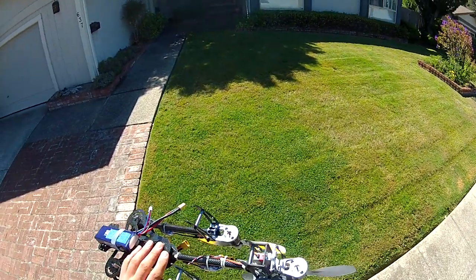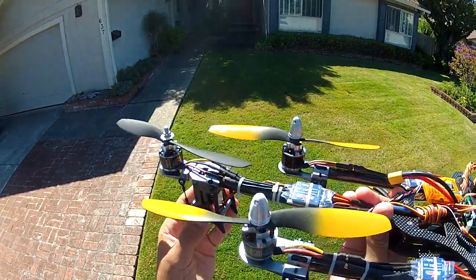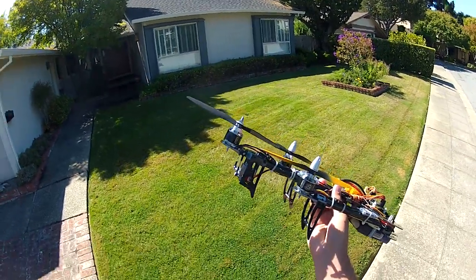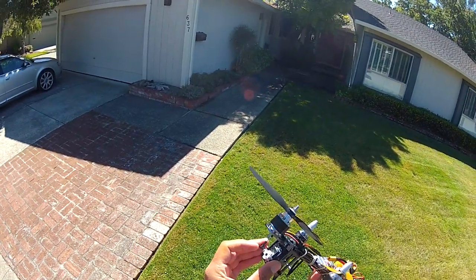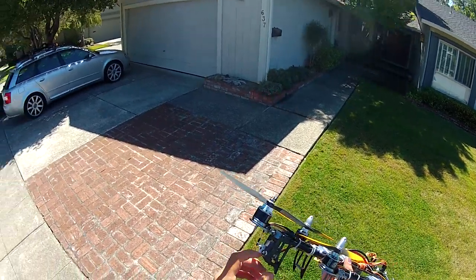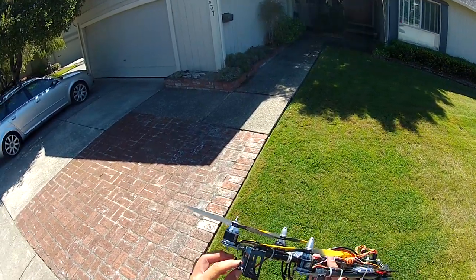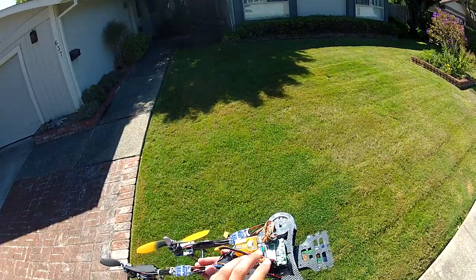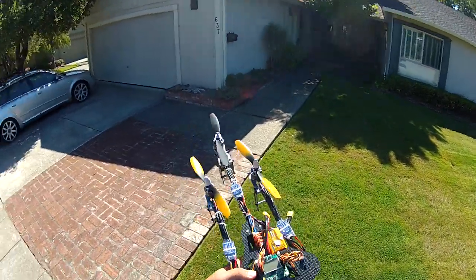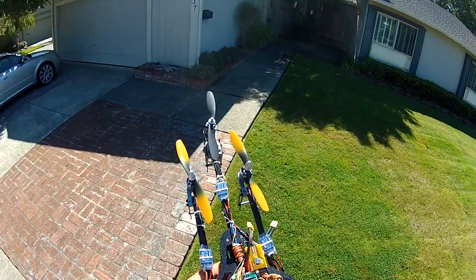I've had quite a few multi-rotors, but what I've got here on the tail is the S306G. It's about a $25 tail servo — really like a 450 tail servo — and it's super quick and super responsive, like a really nice digital servo. A little bit expensive in comparison. I wouldn't recommend doing something like an HXT 900. Make sure it's metal gear and I'd recommend digital, because digitals can respond to the input from the KK2 or really any multi-rotor board much better. You can end up frying cheap analog servos if you're not careful with these boards because of the refresh rate.